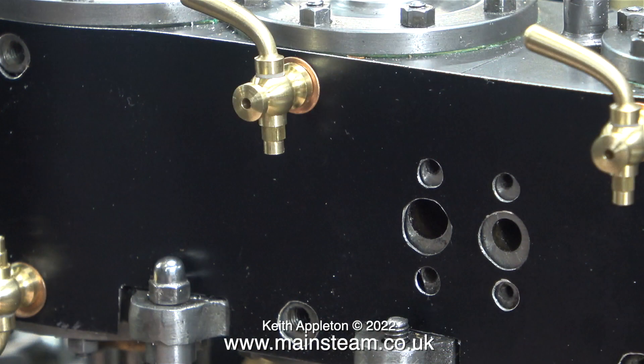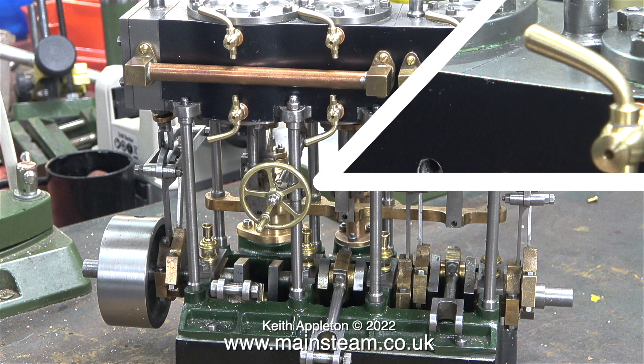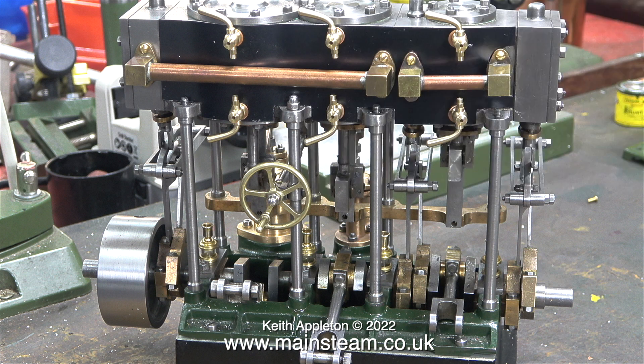The holes still need a little bit of work — they're not quite the right size nor are they in the right place. Here is the problem: I need the holes for the drain cocks to be a bit bigger. If I screw the drain cocks up to the cladding they're not in the right place; when they are in the right place they need a shim washer, and as you can see they don't look too good and they don't centralize very well on the threaded part because the holes are a bit big.